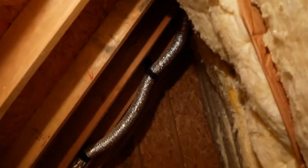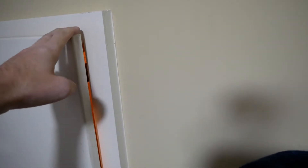We'll have to get that patched up and get this all insulated properly. I'd like to insulate this entire space — along here after we get the baffles in, we can insulate here, and then I'm going to put some drywall in so this whole room is insulated off. Another major problem with the insulation of this area is actually these doors — that unconditioned space air just comes right into this closet. When I redo these closets I'll probably turn them into some sort of shelving with a hidden door. If I can get that space all insulated off and do all these improvements, I think this area right here shouldn't be a huge problem.